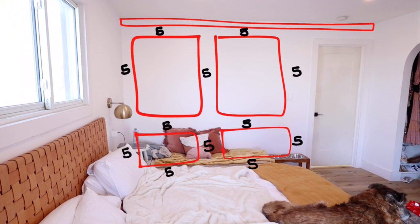Keep in mind that you want about five inches between everything — between each rectangle and between the rectangles and the crown molding. I highly suggest planning this out on paper before you go to cutting because this is the hardest part. It's quite tedious, but when you know your measurements beforehand it makes the cutting a lot easier.